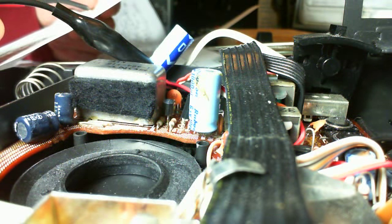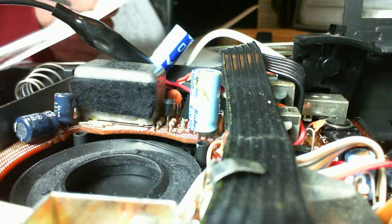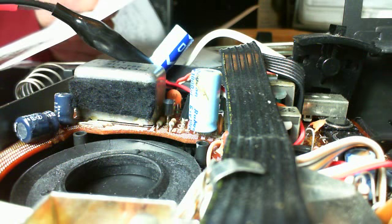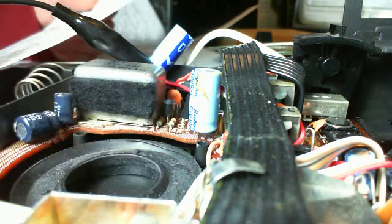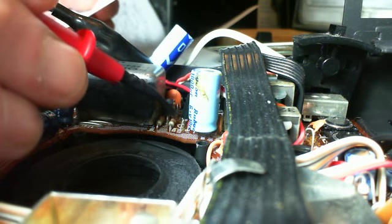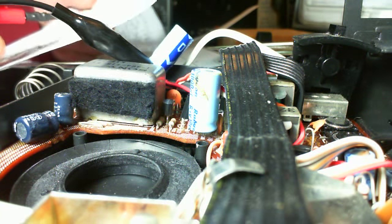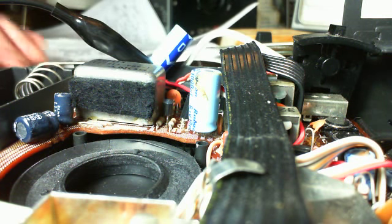That's now on the center pin, which is the collector emitter. I don't know which one of the two. The center pin, we should see 4.4. On the center pin we see 5.6. So I think there you are, right there. I'm getting into trouble. And then the base, driving it, 3.7, and the base is out here. See, the base voltage is 4.8, so that's not correct. So what's controlling the base voltage on that guy? What controls the base voltage on here?